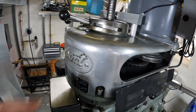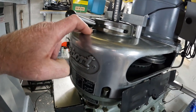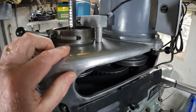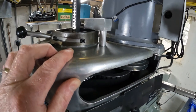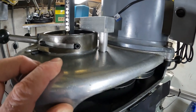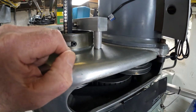The only nut function here is just to lock it. You could take this off and nothing falls down inside there — you'd just be left with the stud. I put a couple of spacers. I could have bought regular spacers for a piece of all-thread; unfortunately I found them in a box long after I made these. If you just make a spacer with a tapped 5/16-18 portion and take the nut off, spin it on there.